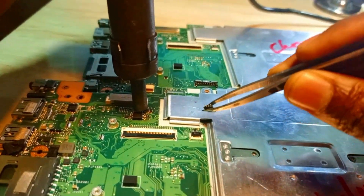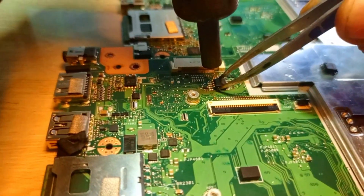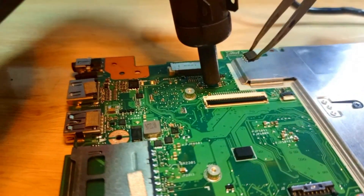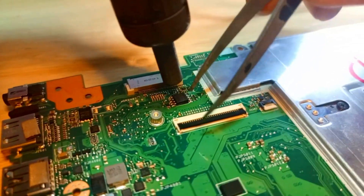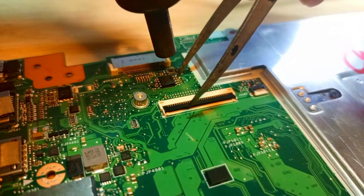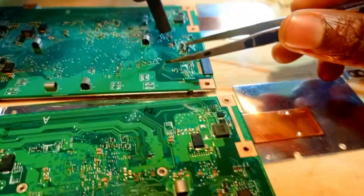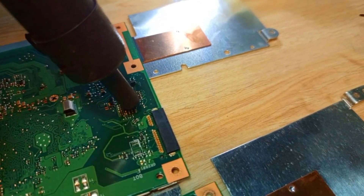This method is one of the simplest — you don't have to type code or use the internet to download. It's much faster if you have one of the Chromebooks that is bad. But if both are good, you can also program the chip. The chips must be the same. You copy out the firmware from the chip, apply flux on it, and be careful with the temperature of your workstation so you don't damage the chip when heating.